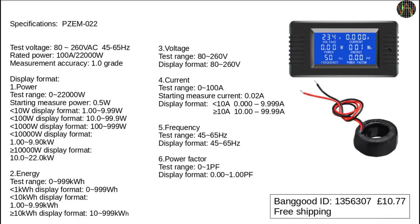Although this is already the most sensitive power meter I found, it is still designed to measure up to 100 amps or a power of 22kW because its chipset is meant for smart meters, measuring the consumption of a whole house or apartment. And while it is fully aware of even tiny loads of just 16mA because it is still calculating real power use, it doesn't bother with calculating the power factor of loads below 20mA or about 5 watts.